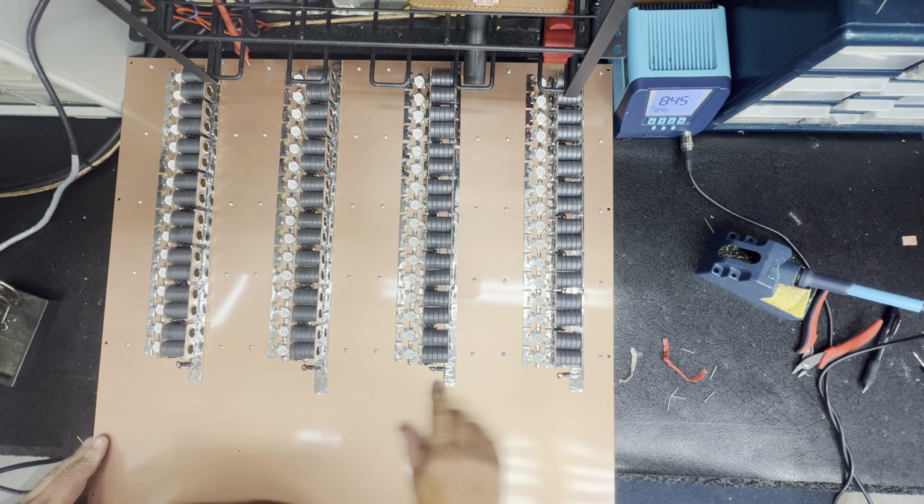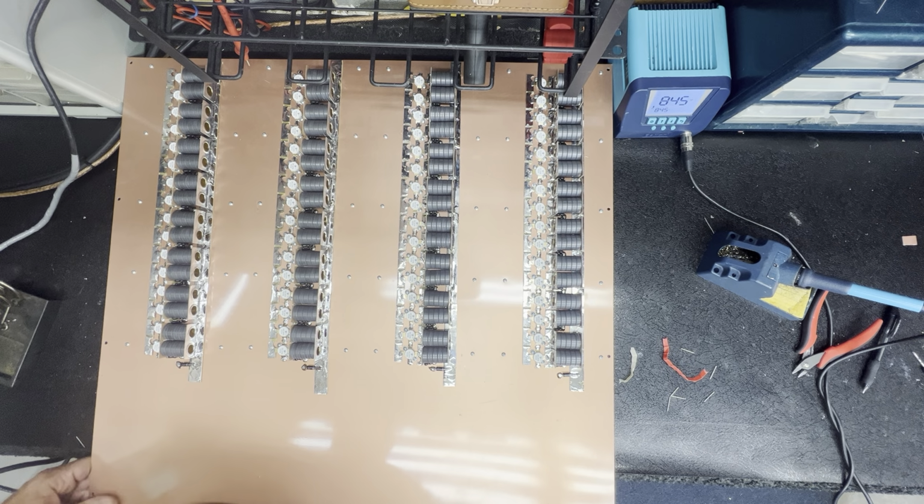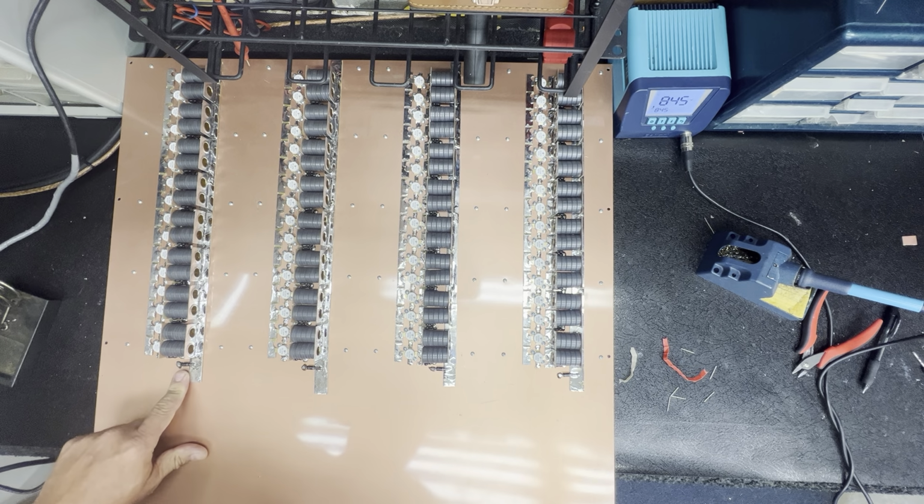No, but I'm putting these diodes on here, and the reason why, well, I can tell you real quick. You put them on there as reverse diodes, they might not stop you from blowing your pills. But let's say Goofus down there hooks his hot and ground up backwards. That diode's gonna pop louder than hell and tell him something's wrong. And if somebody hooks up a linear backwards and they bring it up here to me and try to blame me for blowing the transistors, if that diode's blowed, I can see that they hooked it up backwards. You see what I'm saying?